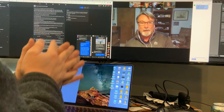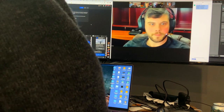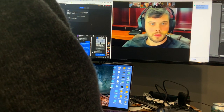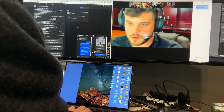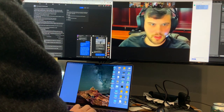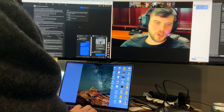Oh, there's a question. ATTI. Yeah. We have the ability to switch to ATTI if you wanted to? Yes. Okay. Yes. Good. Yes, and attitude mode is a very unique kind of beast, too, because it actually still uses the vision sensors to some extent to hold position. Oh, good. To some extent. So it's no GPS, right?